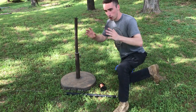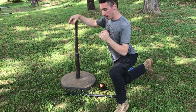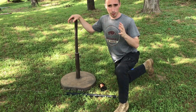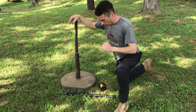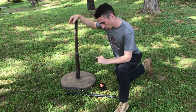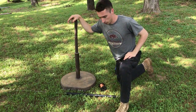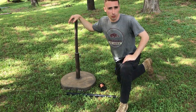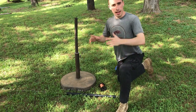I have read somewhere, or maybe I dreamt this up, but I'm going to say about eight 8-foot radials might get us what we need. I'm hoping to use this antenna as another portable option in my radio backpack kit, but we'll see how it goes. If I have to use more than eight radials, it's pretty much garbage for that purpose because you don't want the extra weight and wire in your backpack. So we'll see what eight radials at eight feet a piece give us and go from there.